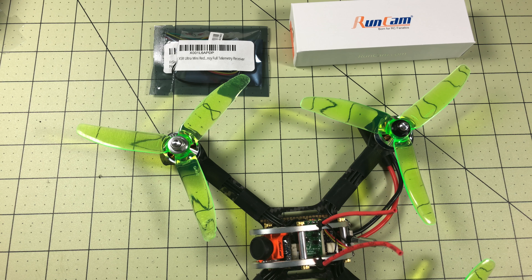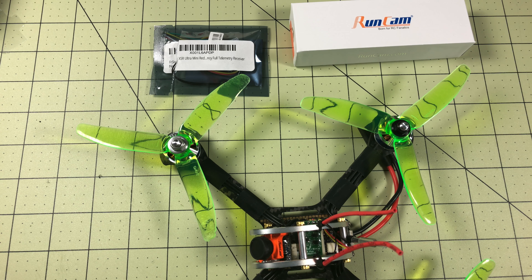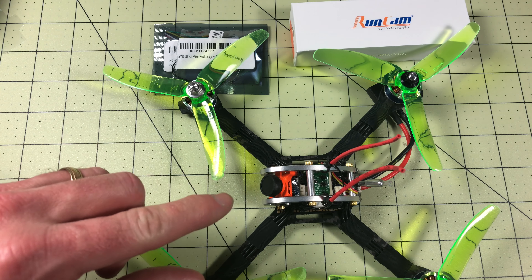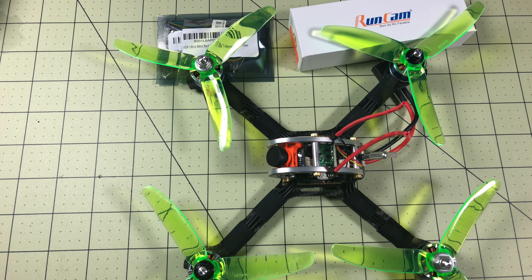At first I thought I wasn't gonna get either and I was very sad and I posted on Facebook — Facebook.com/DroneRacer101. Then Sebastian Koss commented: 'Have you already tried soft serial? Use a LED strip pad or something else?' So here's what you can do. You can pick: if you want telemetry and a really good receiver, install the RXSR. Or you can install a RunCam TX200U — the VTX with telemetry. Either one should work. I'm going to pick the RunCam because I've never used it before and the VTX needs upgrading. So we're going to take this apart, find all the pads and connections, figure out how to wire everything, get it done, then try it. In DroneRacer101 style I will show you every boring step.